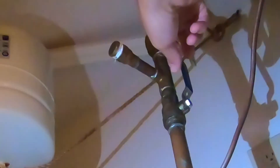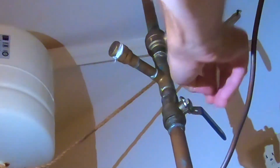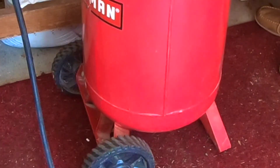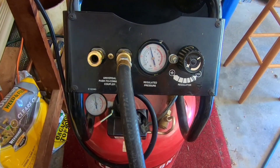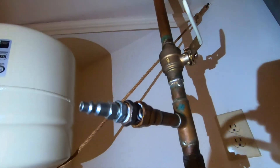So this is the basic process. You're going to turn off the water to the irrigation lines inside the house. We do that because the water starts from a conditioned airspace and then goes to the outside, so we're going to turn it off in the conditioned airspace. All the lines that lead to the outside irrigation system will just have air in them when it's all said and done. We'll use a 20-gallon air compressor to inject air into your irrigation lines and clean all of those out in time for winter.